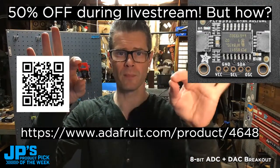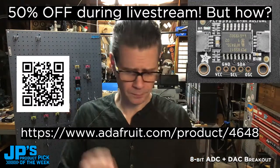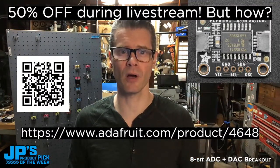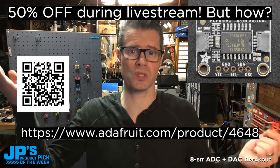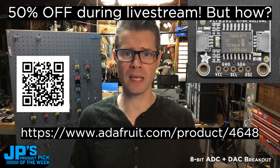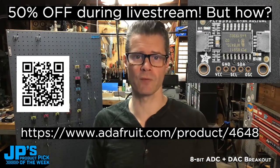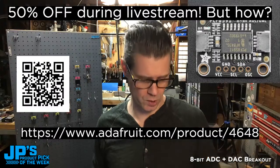You just wire them from board to board with some little short STEMMA QT cables if you want. And now you're adding some serious analog in to a project that could use something tiny. This could be running on a QT Pi or a Pico or a Trinket, whatever you want that has I2C should be able to drive this and read a whole bunch of analog inputs, which is really cool.